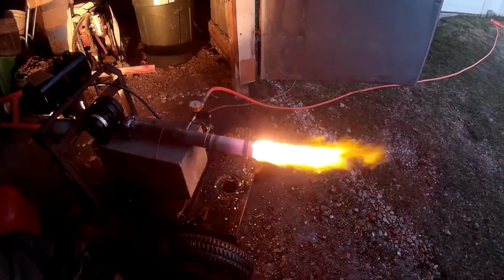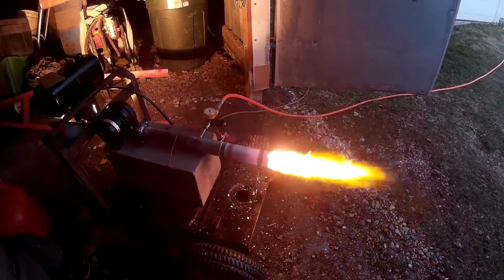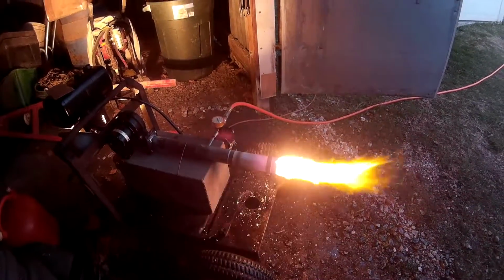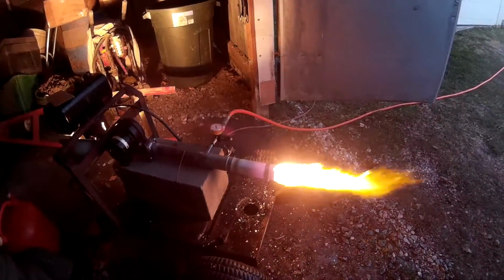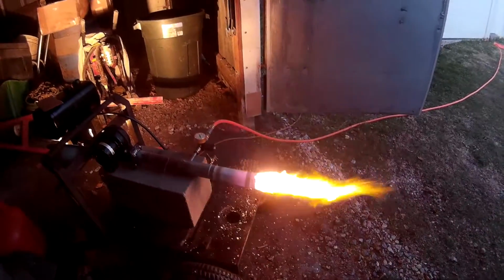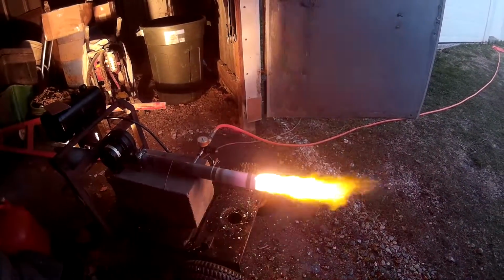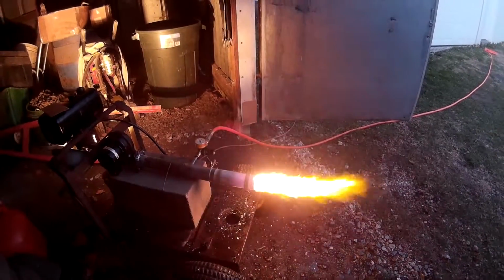So I heated that up and got it cherry red, then turned on my air through the regulator there and opened up the fuel valve, and she lit almost immediately, and I was able to pull the acetylene torch away almost immediately, because I started with the hot end on that flare, which gave the vegetable oil something to flash against and gasify. Of course, once it is burning, it's making enough heat to keep it red, so it sustains itself and keeps flashing.